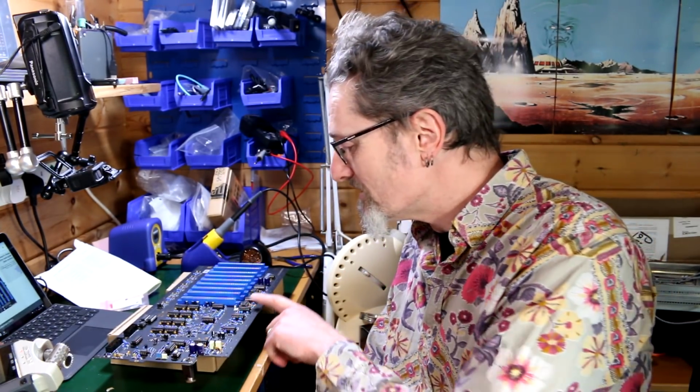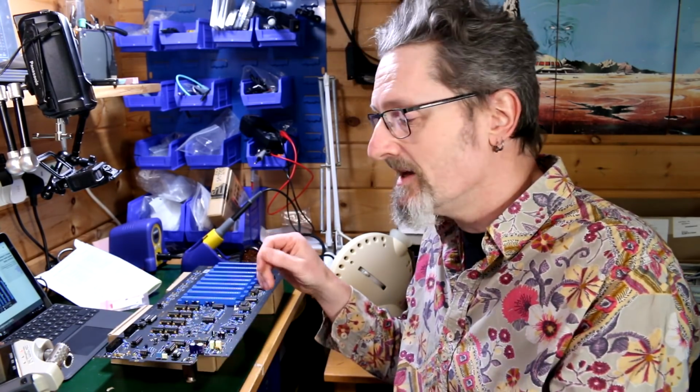I guess that's it. Can I offer you any advice now I've got through the main board? Nah, not really. Just go at it. Keep at it, I suppose. That's all I can say. I made the decision to put all the resistors around the same way, and I think that's ended up being really nice because it looks good. I've had no problem turning things over. It's always good to apply a bit of pressure to the board when you're soldering things with lots of pins that are sticking through, because they can just come out a little bit regardless of how flat it appears. So a little bit of pressure while you're soldering, yeah, that's a good thing.